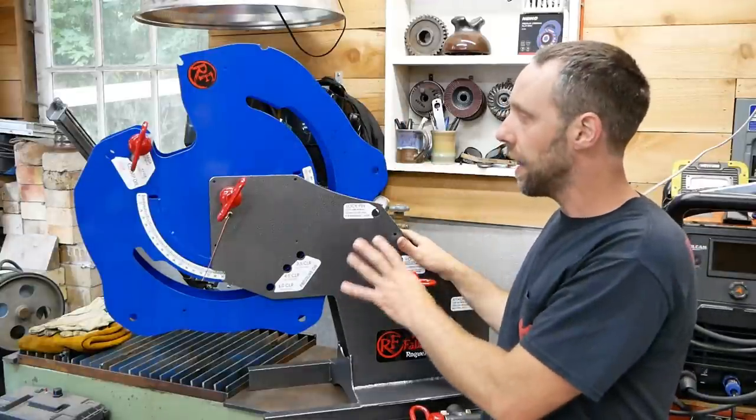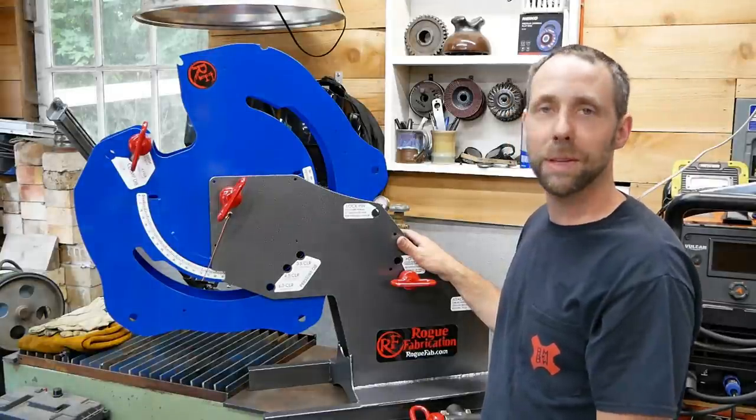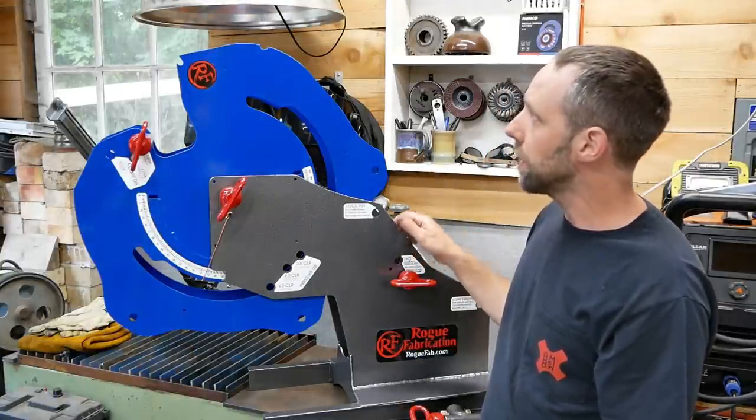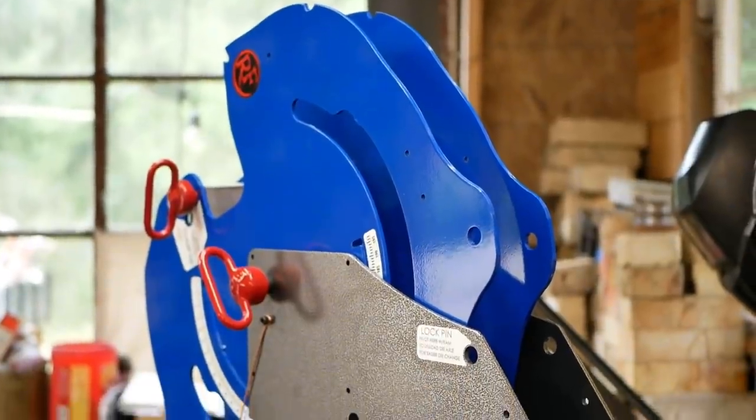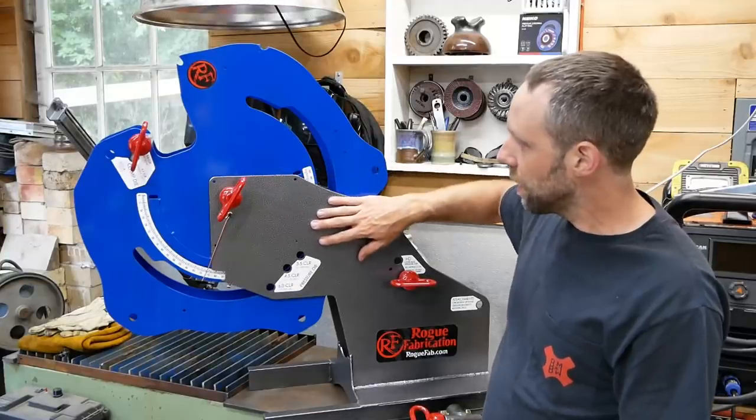And then once we got it powder coated, we put it in the oven, baked it at about 400 degrees for 10-15 minutes. Got a really nice durable paint job. This blue I actually ordered for the quad truck fenders and haven't got around to painting them. I like the color. The body on here is a silver black, kind of a hammer finish, looks really nice.